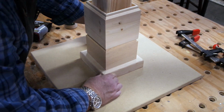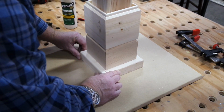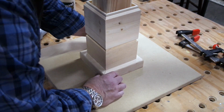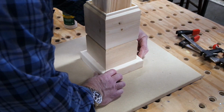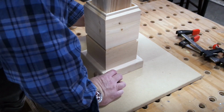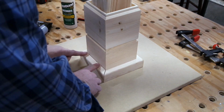A little bit of sanding on the edges just to dial it in. This one's a little off. There we go. That's pretty good. Got a little tear out again, so guess what? Gonna sand, gonna fill some, maybe use some filler. Probably just some caulking. And paintable caulking, so that's really good. Little edge there. Alright, so let's glue it up.